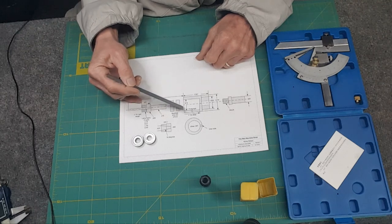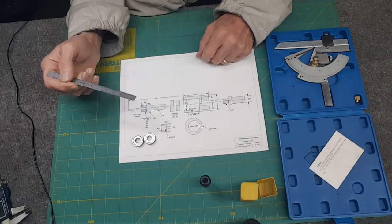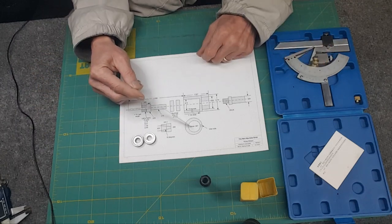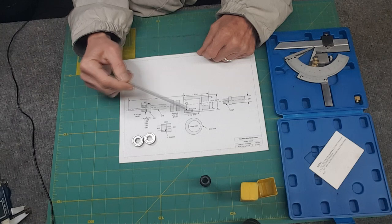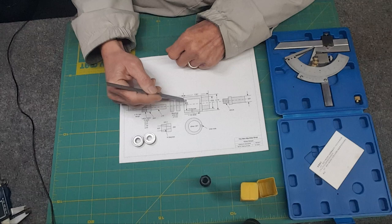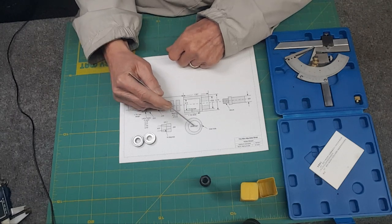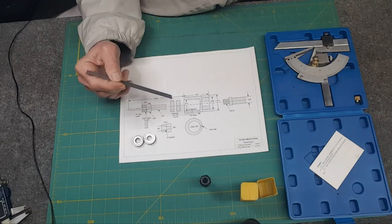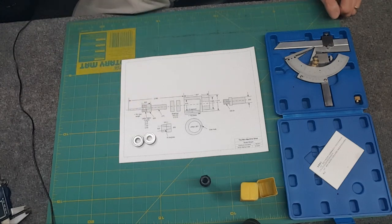So there's the offset for the wobble — this thing is off-center and tilted, and that's what causes it to work. However you want to attach it, one piece or whatever your own design, the offset is the trick. You've got to stick the material in the vise and angle it at 1.8 degrees. Then you've got to visually find the center of it at an angle — you can't use an edge finder because you're tilted — so the guy was doing it with an optical scope to find center, then shift X or Y axis 67 thousandths.